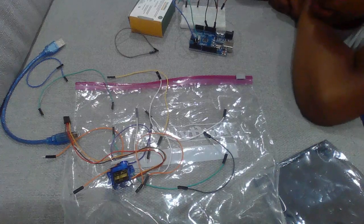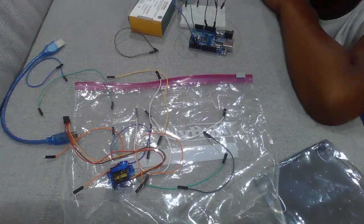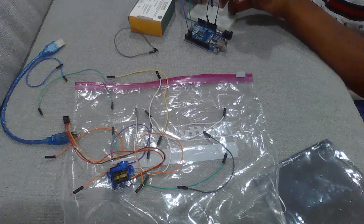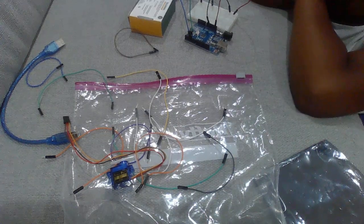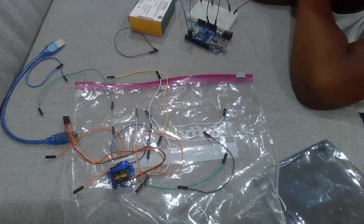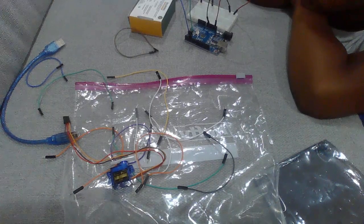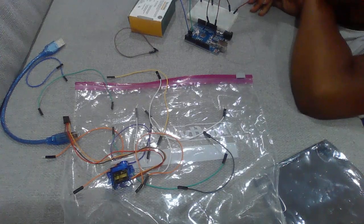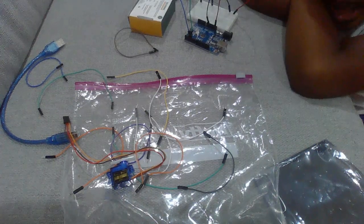Yeah! And I also have this cable to connect it. So just quickly confirm, VCC goes to the positive. Is it going to the positive? Yeah, and I saw the black wire. The white wire is going to the positive, and the black wire is going to the negative. Alright, then we will be left with trigger and echo, right? Trigger pin goes to pin number 3 of Arduino. Is it so? Yeah, and I did the green echo pin. Verify. Echo is going to 2. Is it so?